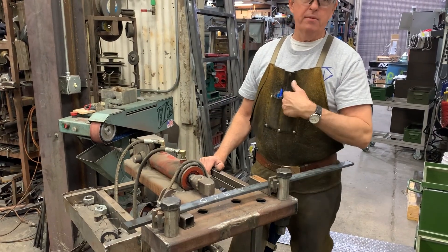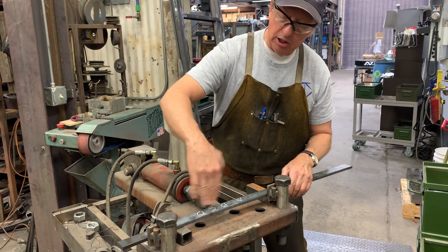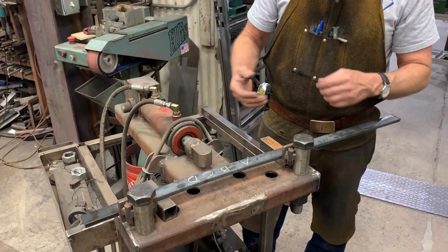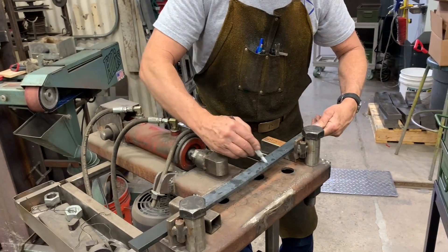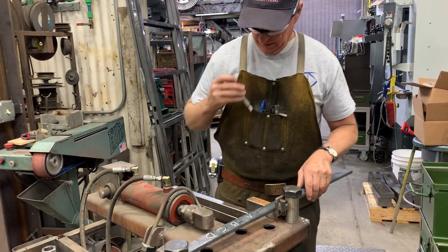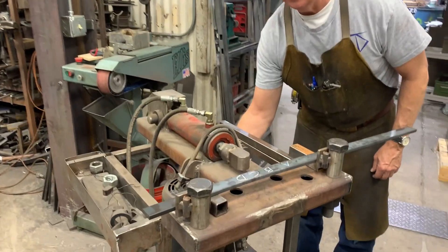I wanted to show you my method of bending. I'm not going to put a series of marks on a bar that I need to straighten out. This bar is three-eighths by an inch and a quarter. I've got a little bend in it, and I've put letters just spaced out equally — A, B, C, D. I can use those letters to quickly identify the point at which I need to bend, as opposed to just putting marks on a bar where you'll get lost and won't remember where you're at. I like to put numbers or letters along the bar, and then I'll go ahead and straighten it out.